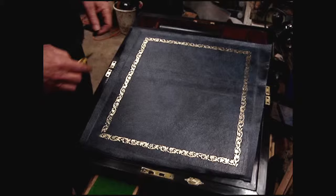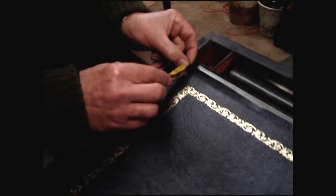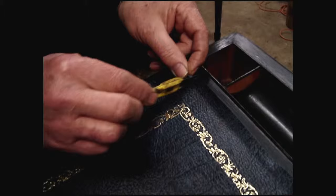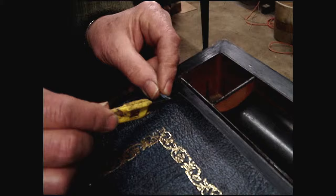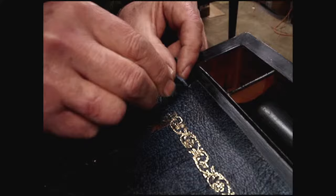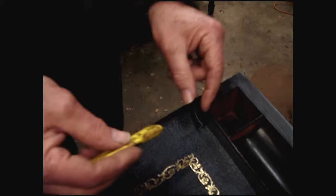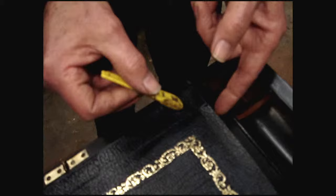I'm going to cut to that line I made with the nail, making sure I've put the line in the right place. Starting with the shorter edges, bringing in the knife — which is as sharp as I can get it — to find where the veneer ends and the inset starts. You don't want to cut at an angle the wrong way, because that will show a very light edge of the leather. So you want to go straight or even slightly angled the other way, but not the wrong way.